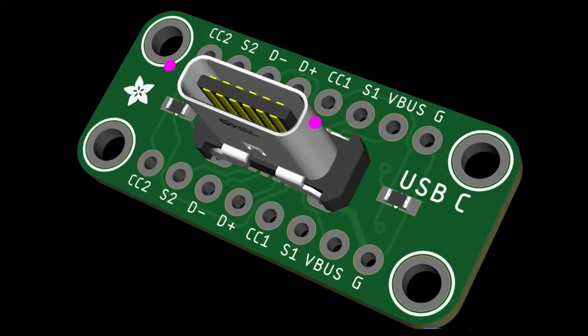All those were from me. But Liz also wanted to get in on the hardware design. One of the projects we're working on is this IKEA Vindrikining PM2.5 sensor that we want to remix the insides of — using an ESP module instead, with a drop-in board that you just unplug the existing board and plug this one in. That PCB design has a kind of vertical USB-C connector, so we're starting by making a breakout for that USB-C connector first. She did a great job making a footprint and wrote a blog post about it. This USB-C breakout with vertical connectivity will be a useful thing on its own.